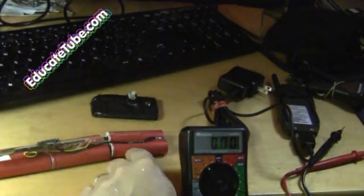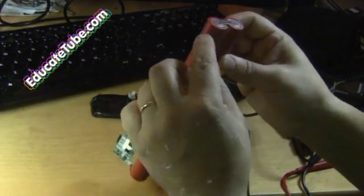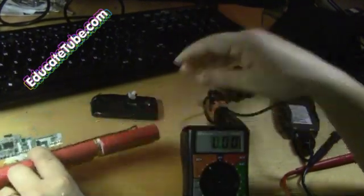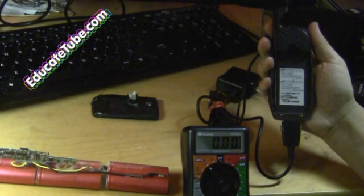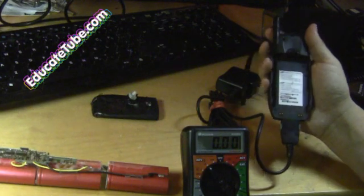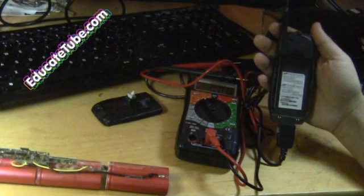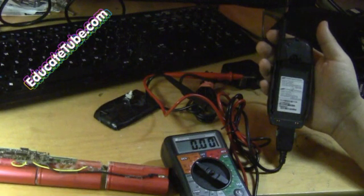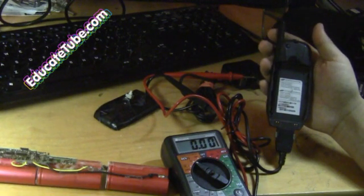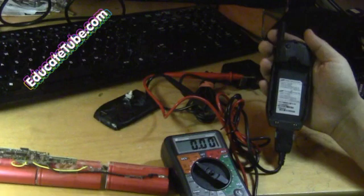I'm going to do the same thing here — take one of these lithium batteries individually, and then charge it using the old mobile phone that uses a lithium 3.7 volt battery. It should be able to trickle charge it, but make sure you monitor it. Don't leave it alone. Monitor the amperage, make sure it's not hot. Once it's fully charged you can check that using your multimeter and you're ready to go. Make sure you keep track of it, monitor it, and don't leave it unattended.